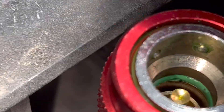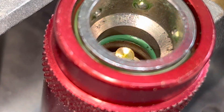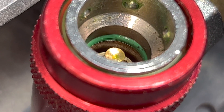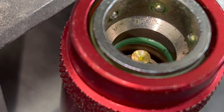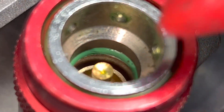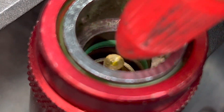All right, I'm not ready for filming — I just decided to do this last minute. You see that nick there? See that little tiny scratch? That will cause an o-ring leak. I took this one out of service; that's why it's not hooked up to my gauges, because I have to replace that o-ring.